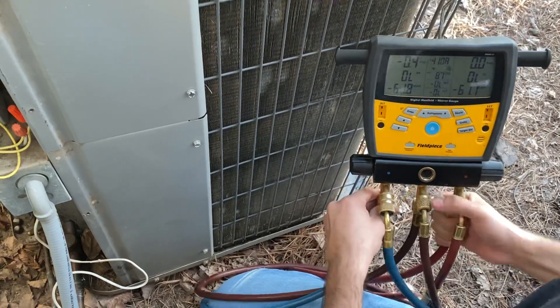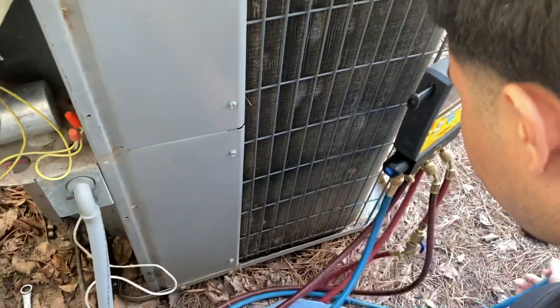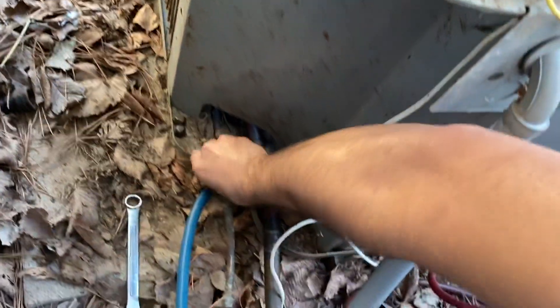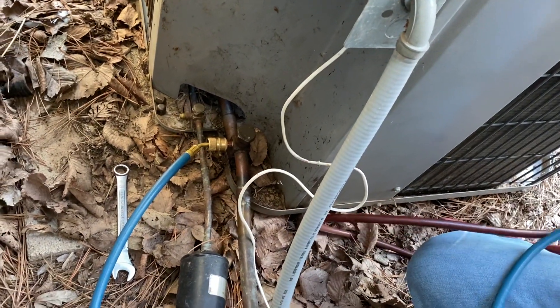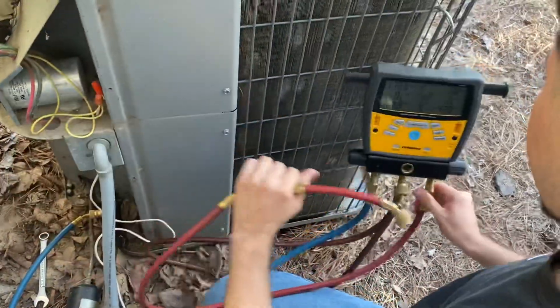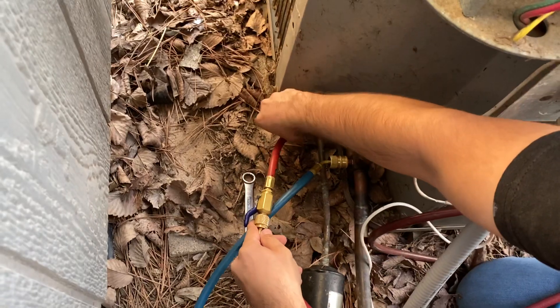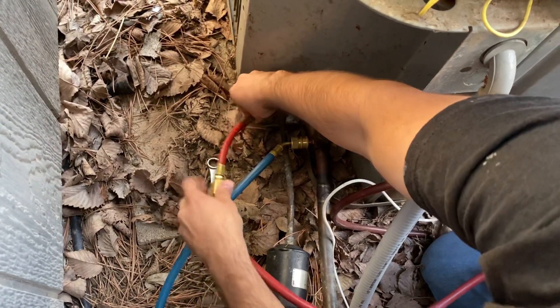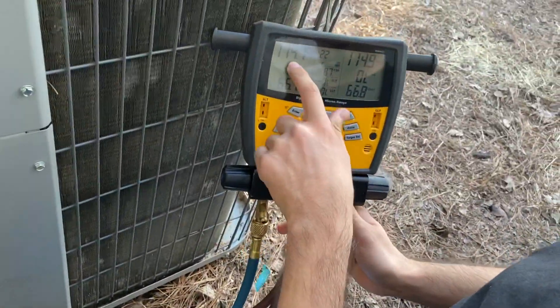There's a little pressure in there, so close them up — you want to hit it at atmospheric pressure and get it to zero. Let's go ahead and hook this up. I'm actually reading about 14 PSI, but that doesn't really matter as long as it's just pressure. You can hook up your high side — get this one to the high side. The pressures you're getting here are pretty much equalized.